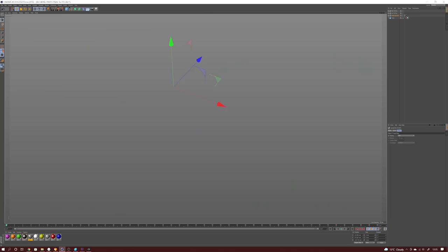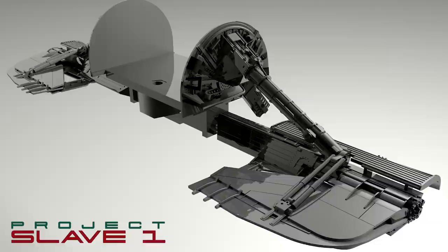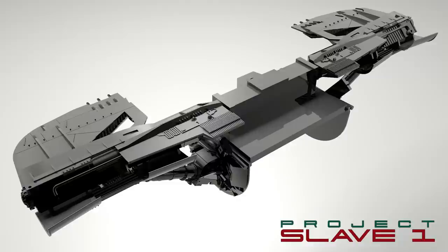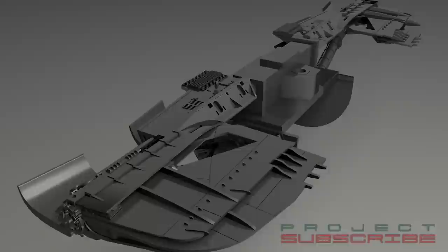With the centre section and wings designed I could mirror the wing to create the other side. There are differences to the two sides on the studio model and I've recreated all those I can find. The total width of this unit is about 2 feet or 600mm, so it looks like my printers are going to get quite a workout. I've tried to match the original studio model as closely as possible and while it may not be exact I reckon I'm about 95% there. I've had to make some compromises to the shoulder mounts as mine don't go as far into Slave 1 as I'd like, but I've added a lot of detail here and I think they'll look just fine. My largest part is the main wing section which is very difficult to split up into smaller parts for printing — I really hope I can print it in one piece.